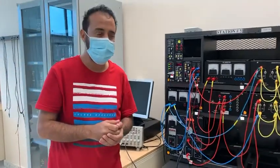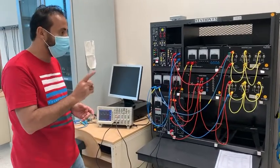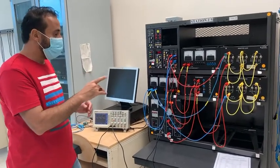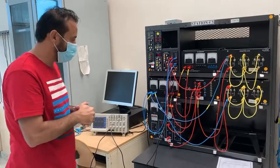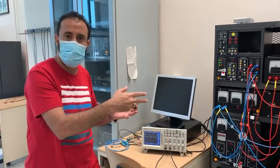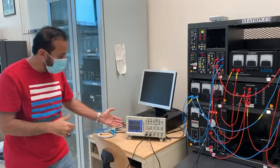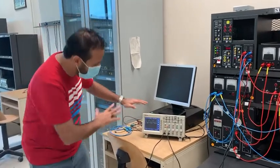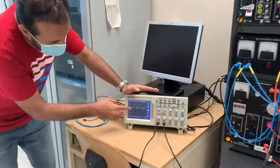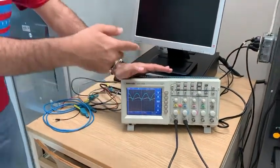This is a single-phase full wave uncontrolled rectifier using a bridge. If we use the center-tap configuration instead, we use a transformer and two power diodes — two half waves. The output waveform shape will be the same, except the peak voltage will be half.